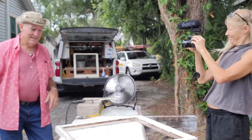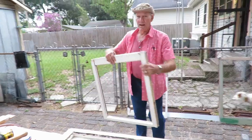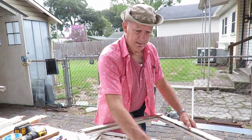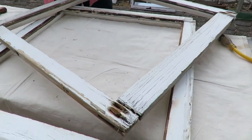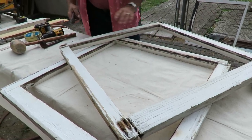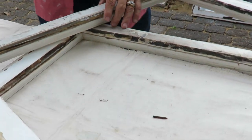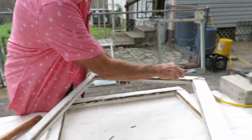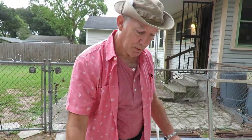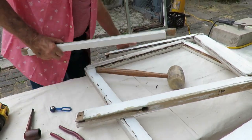You're back — good morning and welcome. We're going to pick up where we left off yesterday. I've got a problem here — a bad segment that I have to remove. In order to replace this I've got to take the whole sash apart. They are held together with little pins, which are nothing more than nails that somebody clipped off back in the day. Once you get these little pins out top and bottom, you can take the whole sash apart.